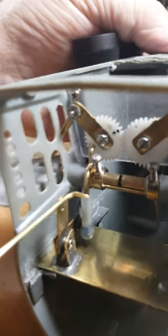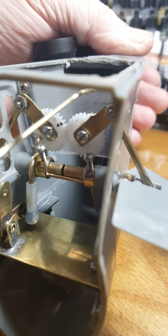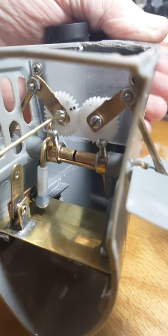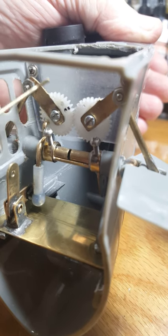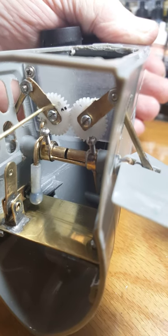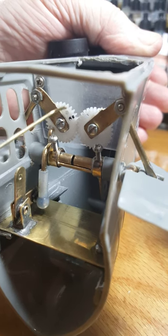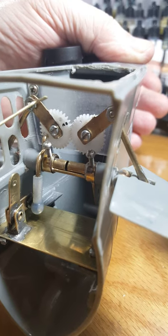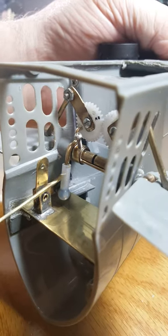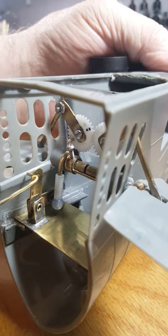I would have used bigger gears but I just didn't have them — the collection I bought were either too big or too small. So I used the smaller gears and a small Z rod right here, and just put a small lever on each one. To attach them I screwed the gear down with a screw, then put heat on the lever until it embedded itself in the gear — that way I wouldn't need an extra fastener. These are 2-56 nuts; I'm probably going to use a different size fastener and a mini clevis right here, because the ball has just a little too much resistance and I don't want to put a lot of strain on the servo.